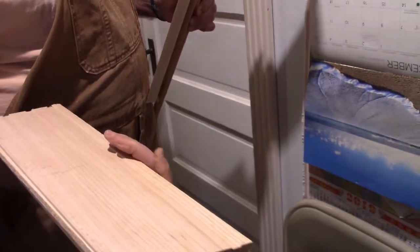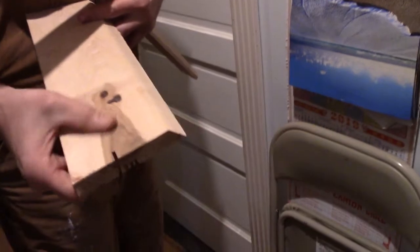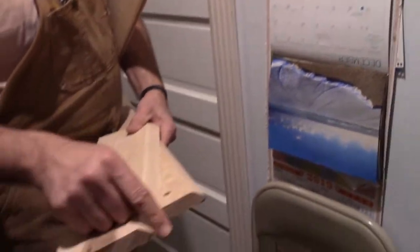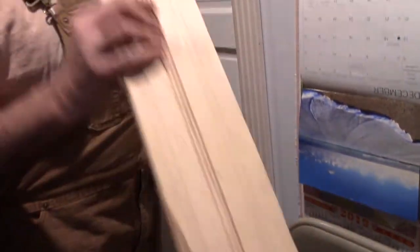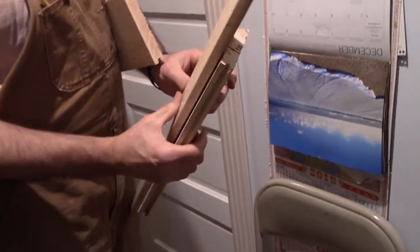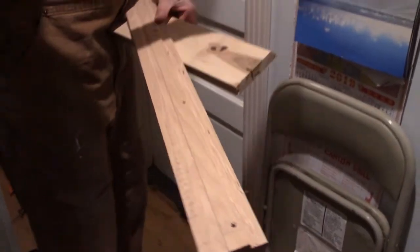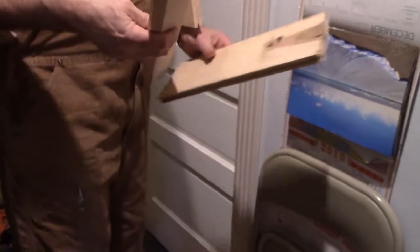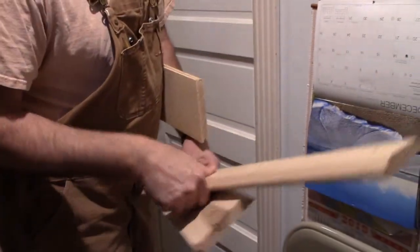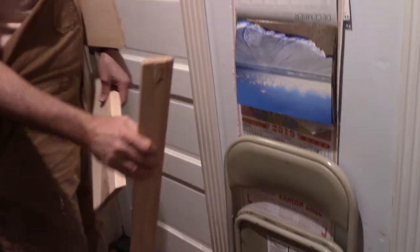This is hickory — usually it's a little more colorful. Here's a piece; it's really beautiful wood and really hard. I decided I'd go ahead and put a 45-degree angle here, and then on the back of it — this is just a test piece — I did some grooves, and it turns out this is what it ends up as. I've made it customized with a little groove to tuck over the edge of the carpeting, and then this comes right down. So you go from a level up here down to here, and it'll be a nice transition.